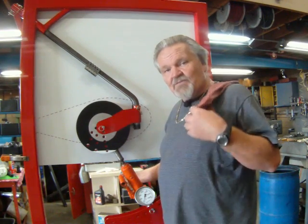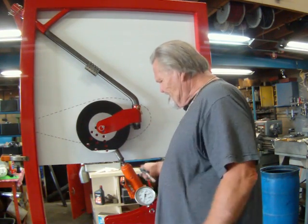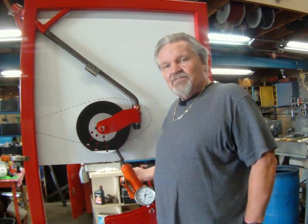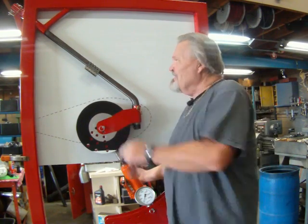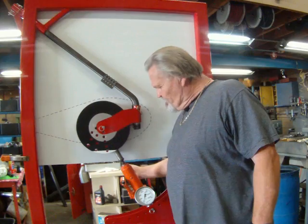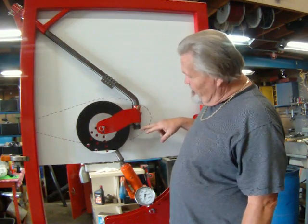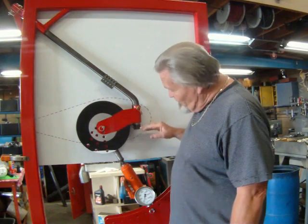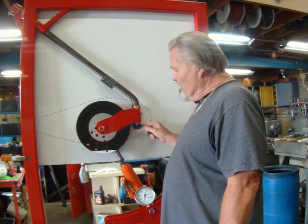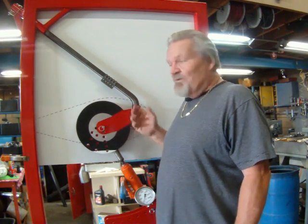It's there more of a safety, that when you take the gear to the point where you run the risk of it taking a permanent set and bending, the gear brace acts as a stop to keep the gear from failing in this point right here where it always fails, where it's the smallest. Now, the advantage, or main advantage, is even if you hit an immovable object that's going to fail the gear. Let's say you were to hit something as high as this, or this is bent down, and so this becomes lower, and you contact the ground with this, it's going to fail. It's going to come back and bend. But it takes more to get this to come down and hit the ground with the gear brace on, by about 3 times more than it would without it.